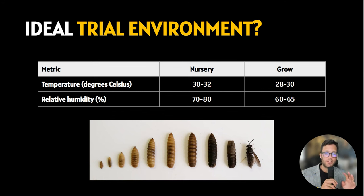There are some feedstocks, so it depends on what system you're using. If you've got an automated system like the ones we build at Flybox, everything is controlled regardless of what feedstock you use. Some feedstocks run hot, so they actually increase heat internally. Some feedstocks run cold, they naturally cool down, maybe from evaporation. Some release a lot of odor and a lot of ammonia. So if you don't have a smart system that can control the temperature at 28 to 30 across your entire container or chamber at every single tray level, then half of your trays are going to be heating up too much because your air system isn't working properly, or your sensors are going to be telling you it's 30 degrees, but actually in between the trays it's 40 degrees because you're dealing with a grain-based feedstock, for instance. And again, you're going to be getting faulty data. So you really have to use the right technology and have the right experts if you want actual data to take to the bank. Otherwise, you're at risk, and that might just be what you need to do in the beginning. But when you have the means, definitely come back and do this properly, because you will undoubtedly discover many good things.